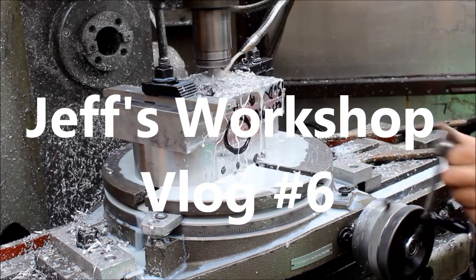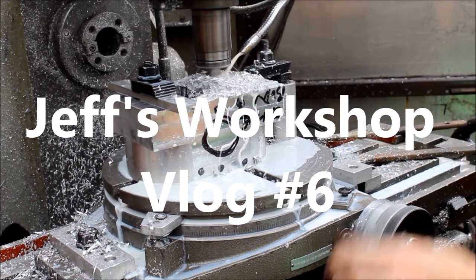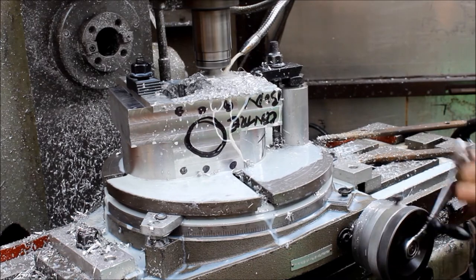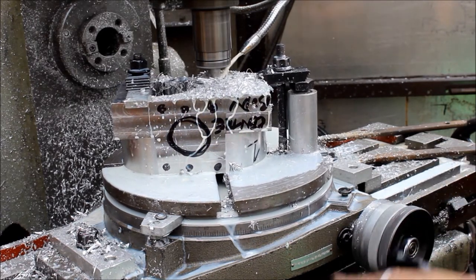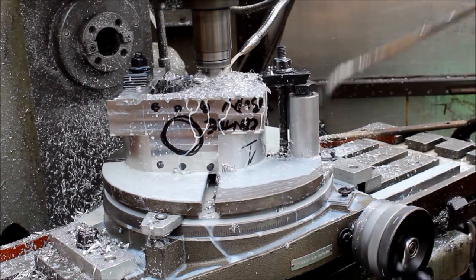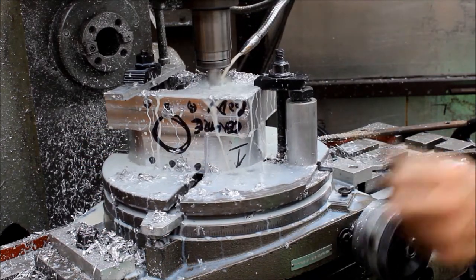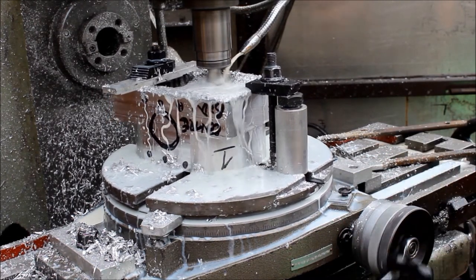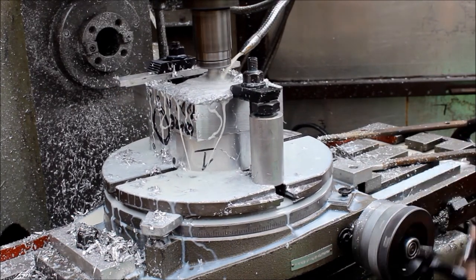So while I eat grapes, tell us what you're doing here. Removing a substantial amount of aluminium from the blower casing. It's going to be the blower case, and as you saw it last time around, you left this ledge here so you can clamp it down on the milling table. With a boring tool, you need a substantial hole in it anyway to get the boring bar in and the tools.